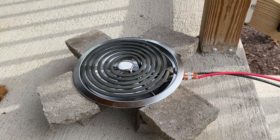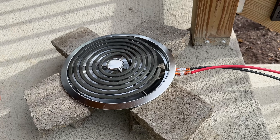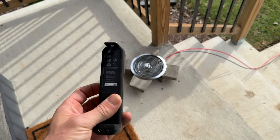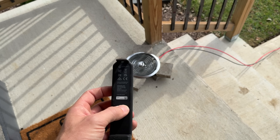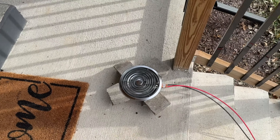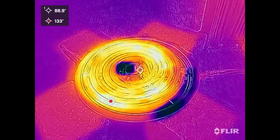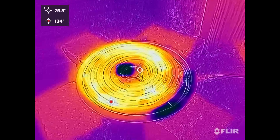This test is just to see how hot I can get that burner — it's a little early, about 10 a.m. It's definitely kicking off heat, but we obviously need to be over 212 degrees Fahrenheit to even have a shot at boiling the water. I'll use this FLIR One that connects via Bluetooth and Wi-Fi to your phone to give a thermal image. Looking at the burner, the hottest spot is only getting to about 133–134 degrees Fahrenheit. That seals the deal — we need one more 320-watt panel wired in series to even have a hope of reaching boiling point.